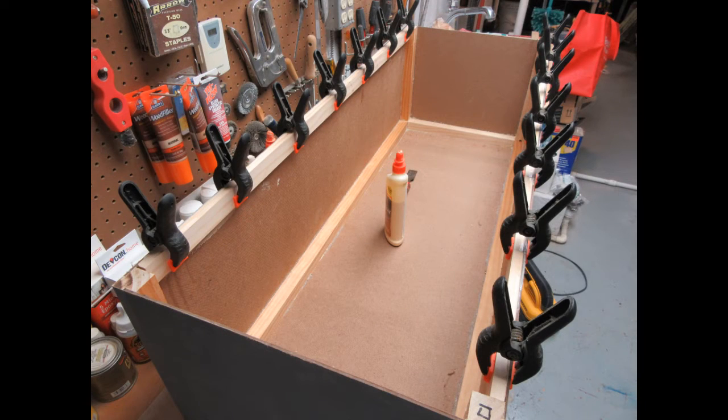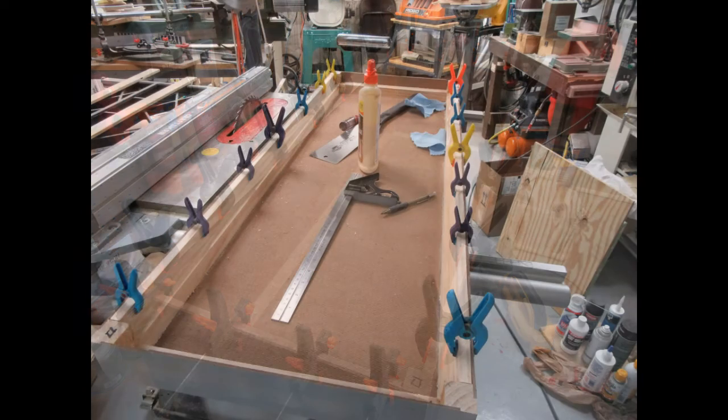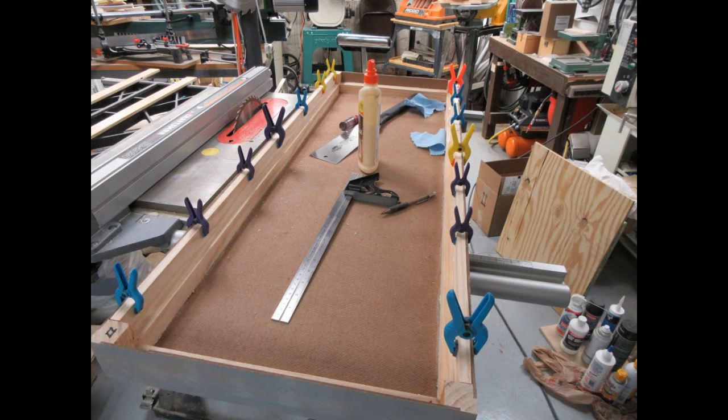On the edges where the case was cut, the thin masonite is rather fragile and needs reinforcement. I could just put the valance on here, but I don't like the way it looks overlapping the masonite. It's certainly uneven at the corners if done that way. So instead I put thin wood strips cut from the original select pine boards and glue those along all of the exposed masonite edges. I typically use 3/8 inch thick wood strips for these larger cases. Here regular wood glue is used.